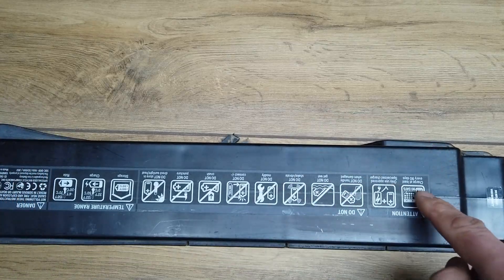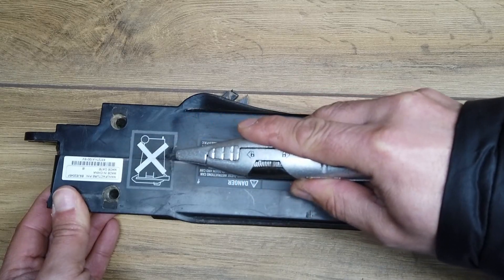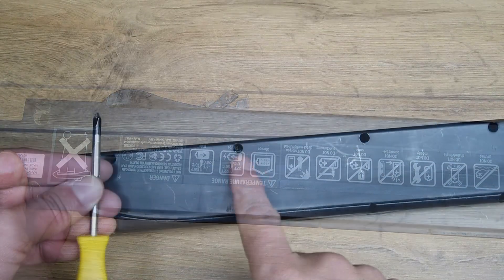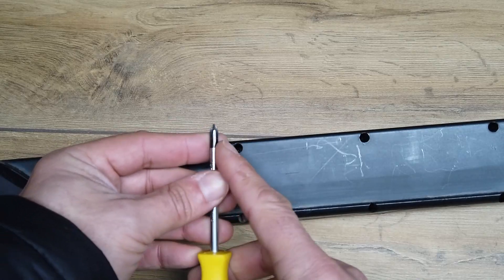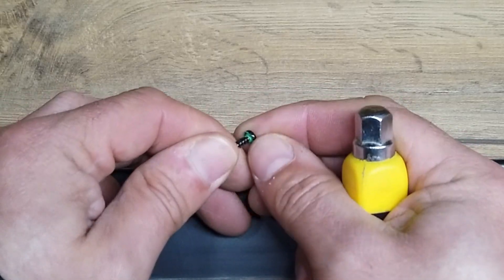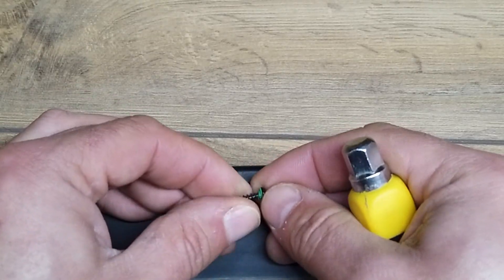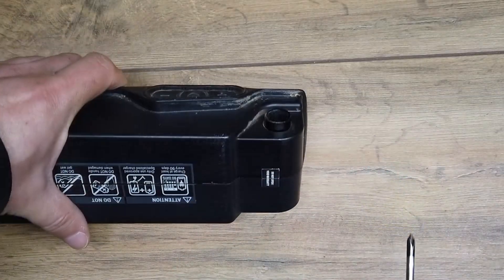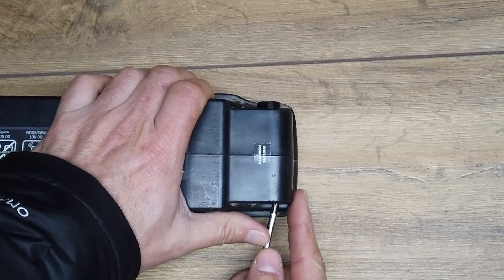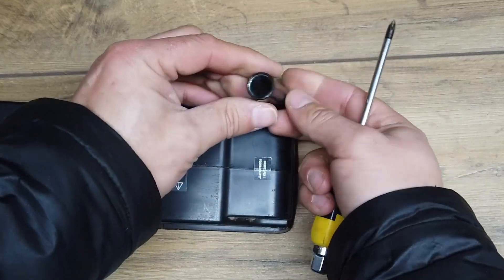Next thing to do is put a knife blade through this sticker. In the side of the battery where the rubber bungs were, there are a bunch of standard Pozi drive screws. Each screw has a little bit of green gunk underneath the head, which I can only assume is related to waterproofing to reduce potential water ingress. The next part of the mission is a support tube bracket that needs to be pushed through and pulled out. There we go, lovely.